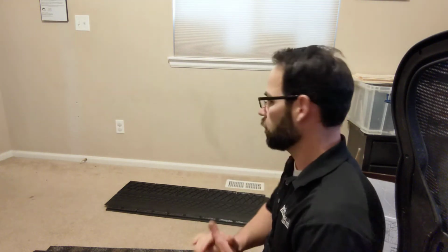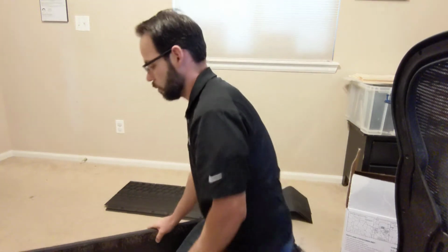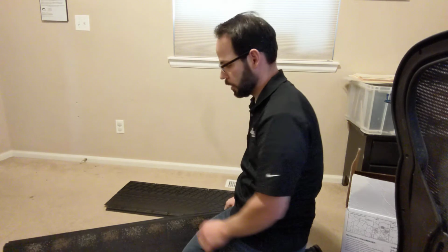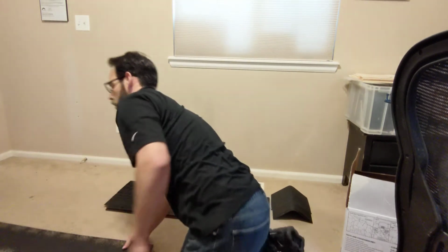So basically it needs a smooth underlayment. Whether it's the felt or the ice and water or what have you, it needs to be smooth. It does require ice and water at the eaves and in the valleys. So you can use non-granulated ice and water, or you can put the ice and water down and then the felt over top of the ice and water. Either way is acceptable for the installation.